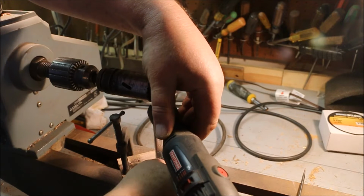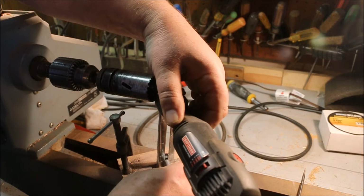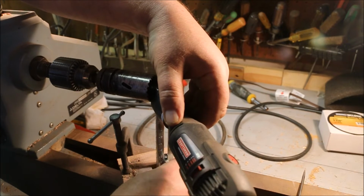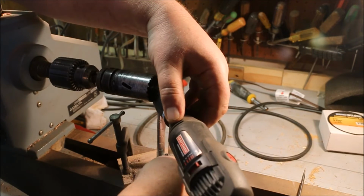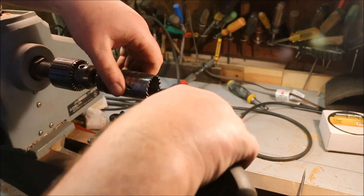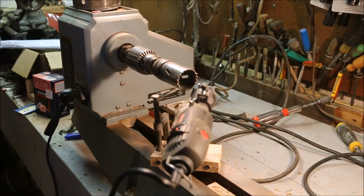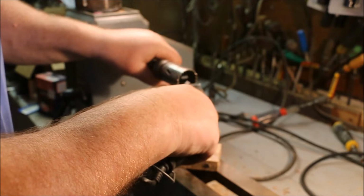By loosening the thumb screw on the bottom of the adjustment fixture, I'm able to adjust the height of the stone so that it centers into the gullet. You have to change this for every different diameter of hole saw that you sharpen. You need to come up with a way that's more rigid, because this allows too much movement.